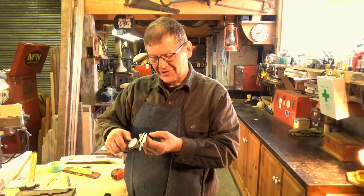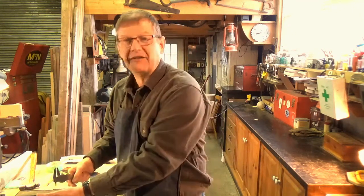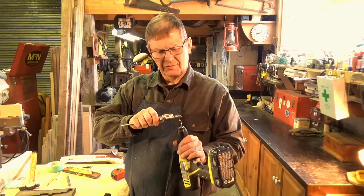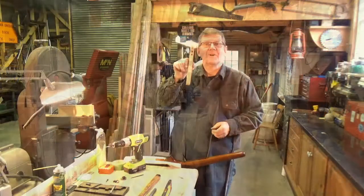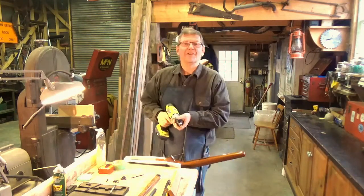When I measure the shank of this screw, it's about 161–162 thousandths. I've roughed this on the rough grinder and right now the diameter of this pilot cutter is about 170 — I think we better go over to the fine grinding stone and finish it. Albeit it's far from perfect, I think it might work just fine. However, I'm not seeking another rich opportunity with that stock over there, so I'm going to try it in a scrap piece of wood first. I tried it at three different places on this piece of scrap cherry and it seemed to work just fine. Time to drill a hole in the stock.